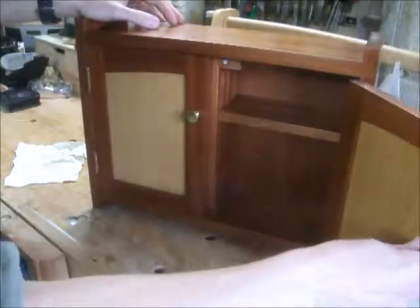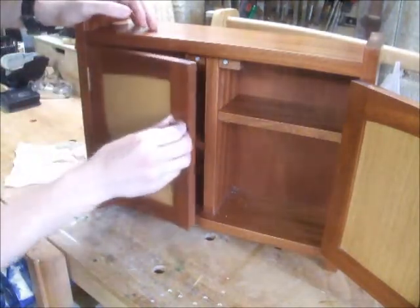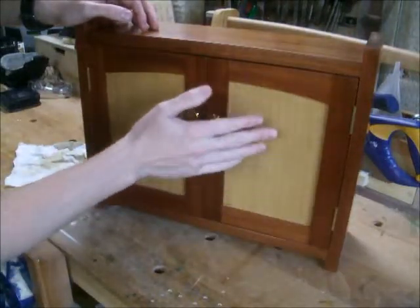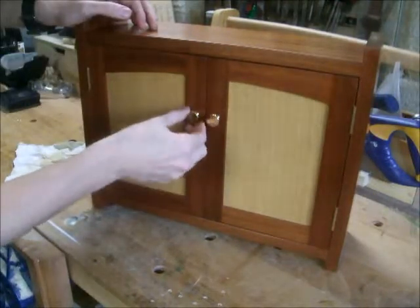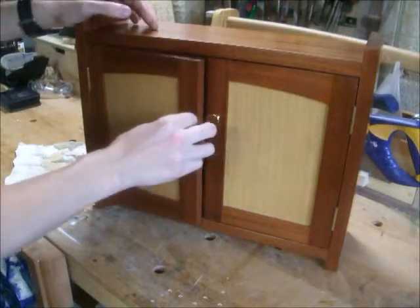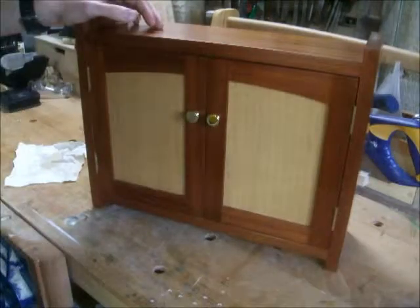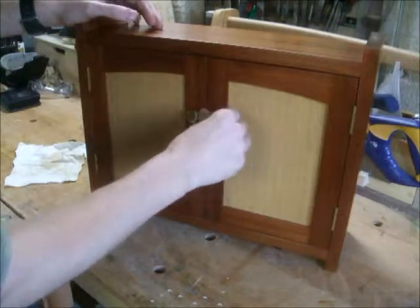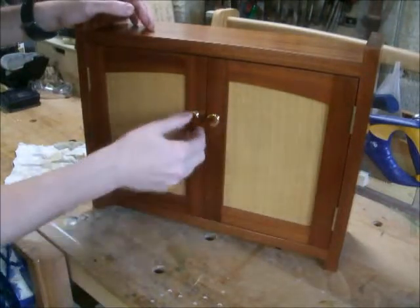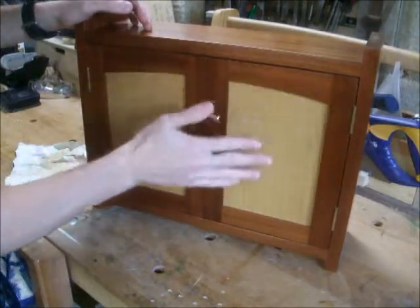It's not my finest piece of craftsmanship. I remember making this thing and a lot of things actually went wrong — some things even very badly wrong. These panels here are veneered oak — MDF with oak veneers on either side. Originally I cut the oak veneers on my bandsaw, that went fine. I got them into college and glued them onto the MDF with a veneering press. The veneers were quite thick, so I thought I'd put them through a sander — that's where it went wrong. I ended up with patches where it had gone through the oak into the MDF on both panels, so I had to throw it away and start again. It's a shame, because I had some really nice oak, even nicer than what you can see here.